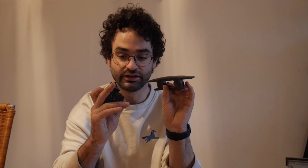So, four-inch forged carbon fiber cleat — first attempt, mostly a success. I do have to work on the molding technique. I was kind of expecting to have to break the mold to get it out, but with some improvements to the mold design and using some PVA, I should be able to get the part out and reuse the mold. Or I could remake the mold using a different material.